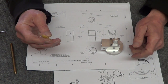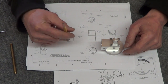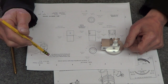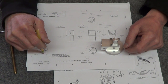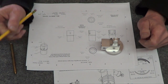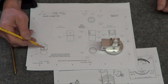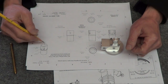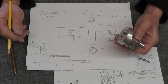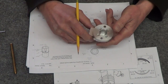I only have a 1-inch piece, and I don't want to do this part in the 3-jaw chuck. I want to do it in a collet. So I've got to find either a 3/4 stainless or 3/4 1144. I'd really rather do it out of 1144, because I know I'll be able to get a nice clean groove. My test was fine. So I'm kind of stuck right now. I guess I've got to look for some material and see what I can find.